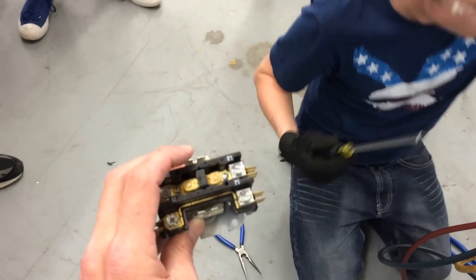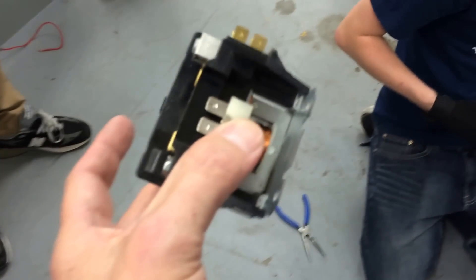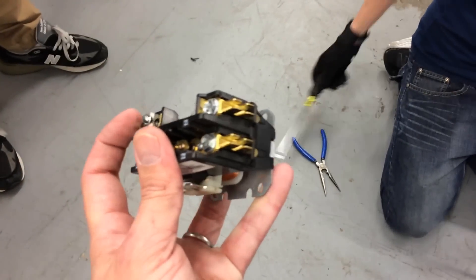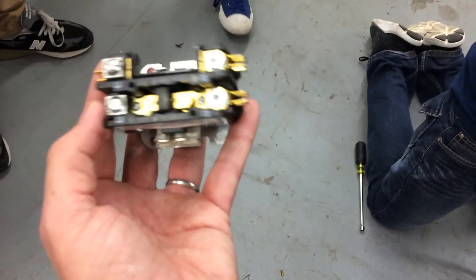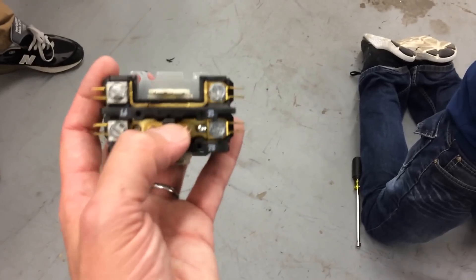I've got a slide that shows a side view cutaway of this and how it operates. There are two circuits here. One circuit is the control circuit — the coil — that's the 24 volts. You had to shut off the air handler before removing this because the 24 volts is not with the disconnect on the condensing unit, it's upstairs. The other part is the L1/L2 circuit. On L1 there's no break — it goes directly with a bar to T1. L2 has the set of contacts. There's another contactor design that has two poles and breaks both sides, but most are now just single pole contactors.